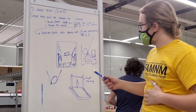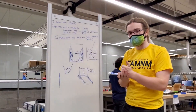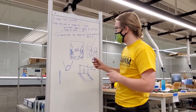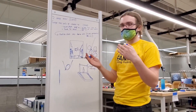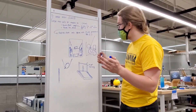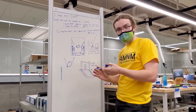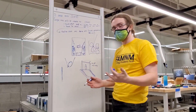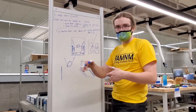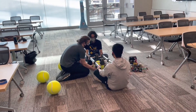We also talked about getting game pieces into the exact spot we want them for the shooter mechanism so it's consistent and the same every time. We've vaguely talked about making some kind of funnel — just a sloped plate that encourages the balls to go in one at a time into the shooting mechanism. At the bottom we'll have a narrow spot with a wheel to index the balls and stop them from going in when you don't want. The wheel is run by a motor that we can turn on to shoot the ball into the shooting mechanism.